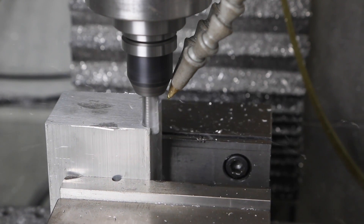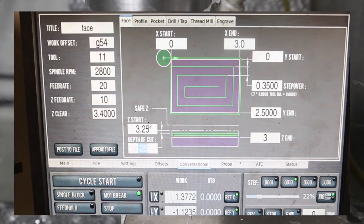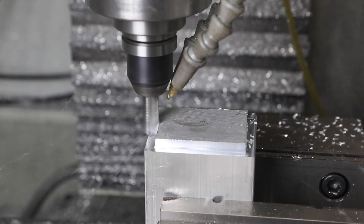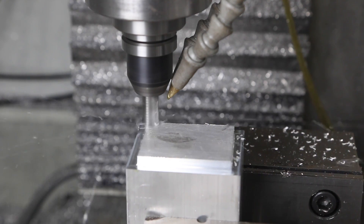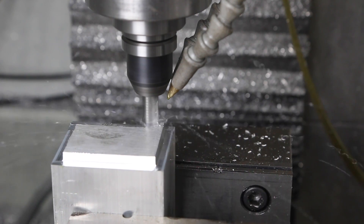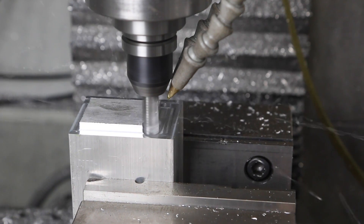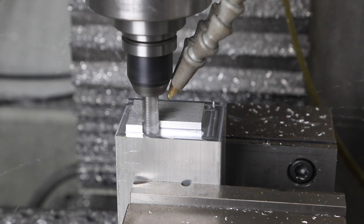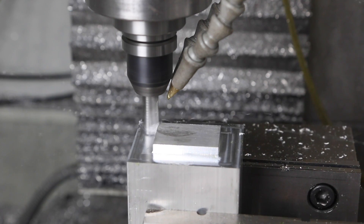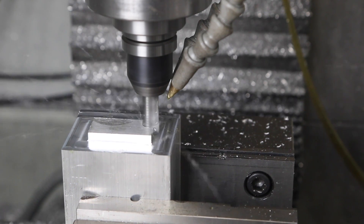So far, so good. I actually don't like that — I'll show you the screen again in a second. The screen made it appear that it would generate a little bit of an X lead-in. Now, that could be dangerous if it would crash into something, but in this instance I would have preferred to have that, and I think the screen kind of made it look like that. So I may mention something to Tormach and see what exactly the intent is there. Obviously, you could just program a little bit of extra X or Y — whatever cut distance you prefer — that would prevent plunging straight down, though you would also be cutting some air. I would argue that when you're doing this, it isn't really a production thing where you're concerned about a few extra seconds, so probably not a big deal — but nice to know you can do it right.